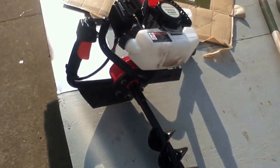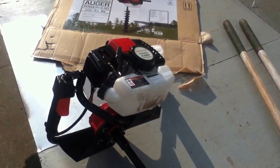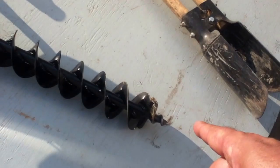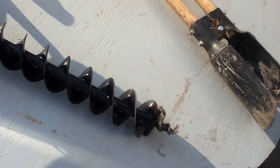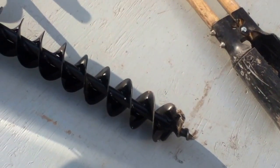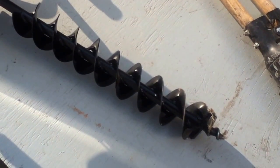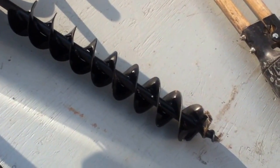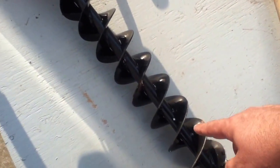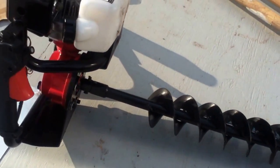There's been some remarks on other YouTube videos about what happens when a one-man auger hits a rock or root. If you have that thing sharpened down at the end, it's just going to cut a root. If it's a big thick heavy root it'll take a while, but it'll cut it. Little roots it just goes right through. Just do a little sharpening down there. All the screw stuff is just for carrying dirt out of the hole, so that can stay the way it is.